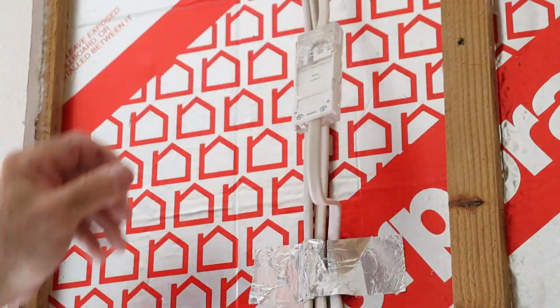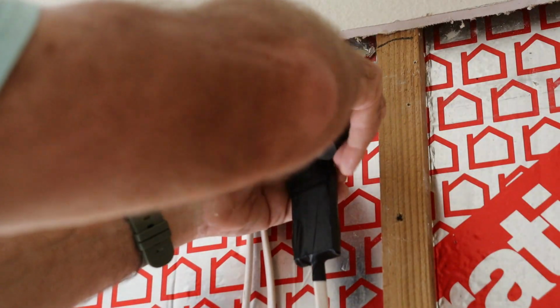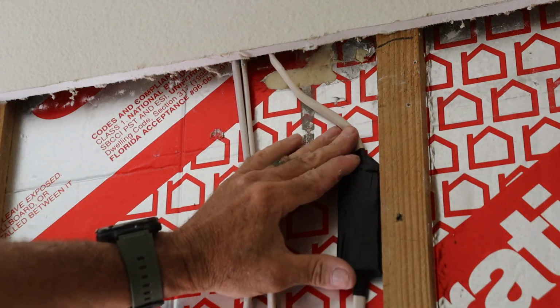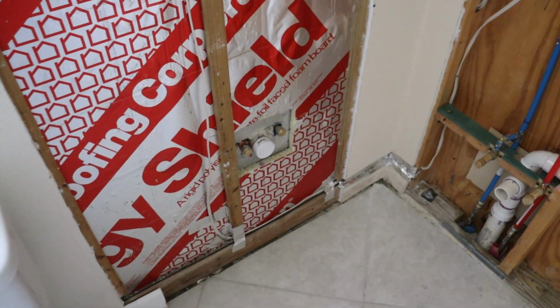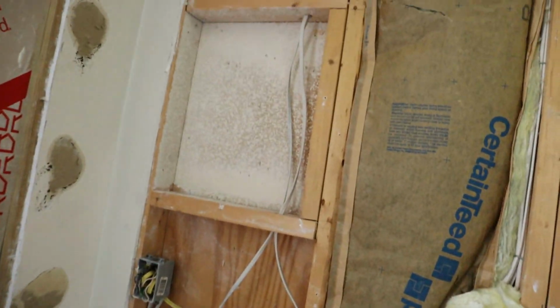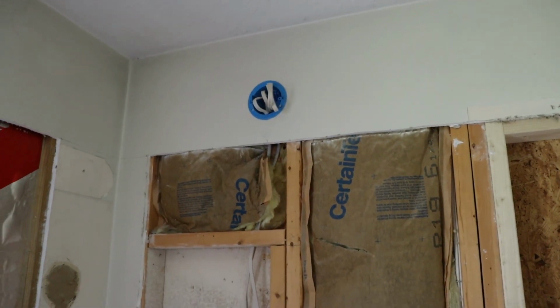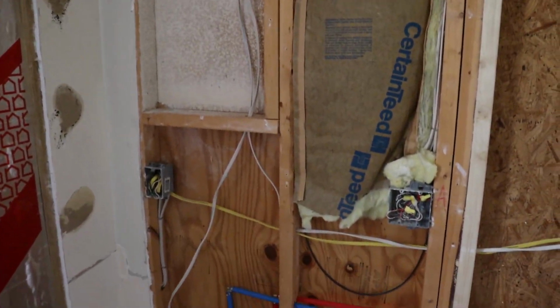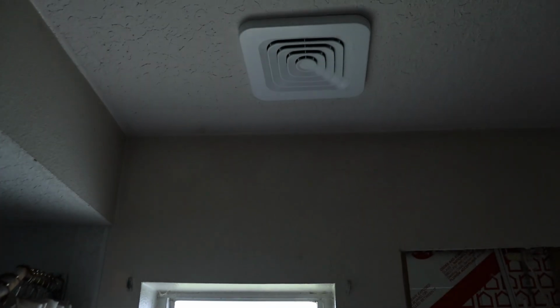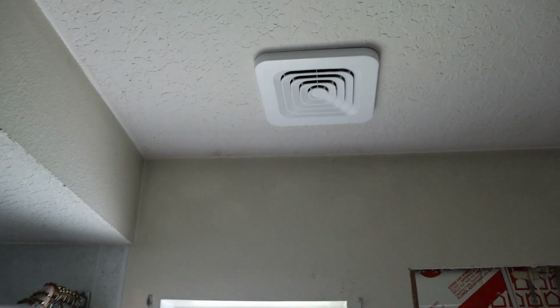I went the extra mile and wrapped the whole assembly in electrical tape, just for added peace of mind. That let me avoid the attic entirely and run the lighting conductor cleanly through the wall behind the new vanity. I installed 2 lighting boxes, one over each sink, and ran 14 gauge 2-wire with a ground to each box. While I was at it, I also decided to replace the bathroom exhaust fan and add an LED can light in the shower.